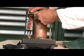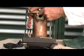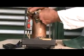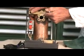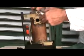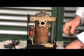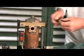Well, it's the same way with these sight glass seals. You tighten the nut. I might have to change wrenches. This one's kind of... You tighten the nut until it just feels tight. You can always go back, if you don't have it tight enough, once you power up and pressure up, you can always go back and give it a little more. Now, this is a real boon for me.